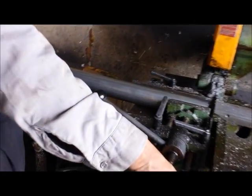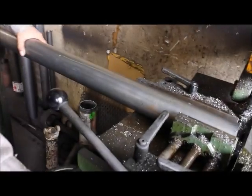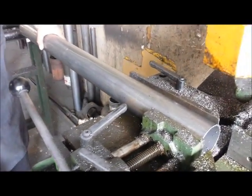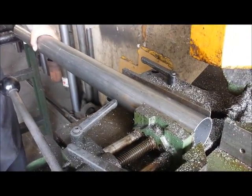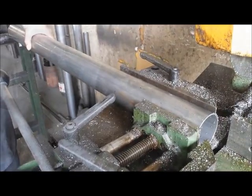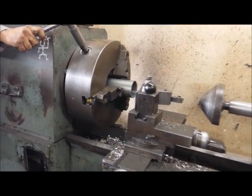This is the piece that Tomas just cut for our driveshaft. The material is DOM mild steel, 3-inch diameter with a wall thickness of 0.083 inches. Now we're putting it in the machine — we're going to face it and get all the burrs off and square it up.